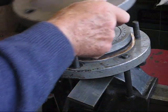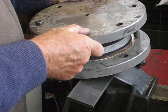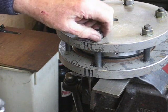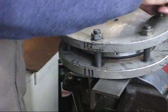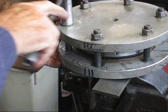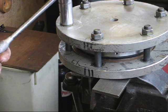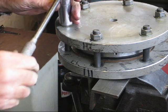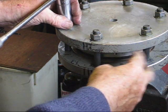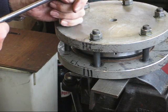This is the final piece to go down. After some difficulty getting all the bolts up, it's all ready now for tightening down. I use as much force as I possibly can. With the bolts as tight as I can get them, and as I don't have a torque wrench, I measure the distance between the plates with my vernier and make sure they're all tightened down to an even distance, as tight as I possibly can.